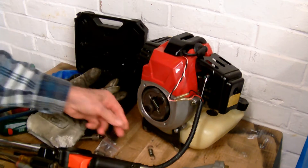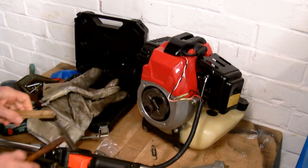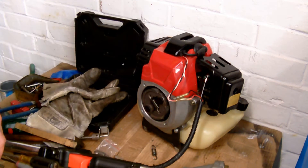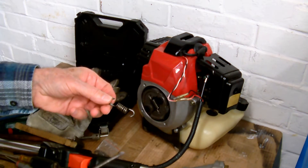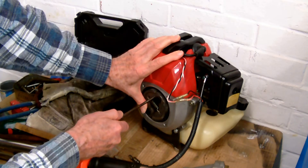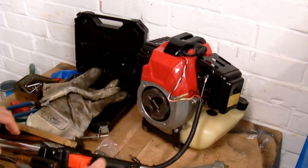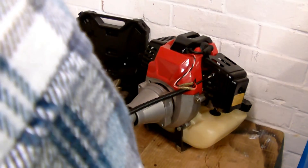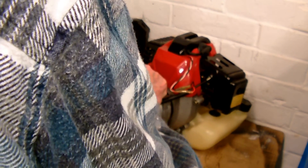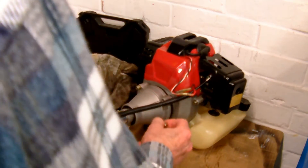It's still standing proud, so then you can just get a piece of wood and a small hammer and tap it in so that it clicks into place — and that ain't moving now. When I had the old spring in there with the destroyed temper I could lever these apart quite easily; now I've really got to try hard to do it. So that's going to fix the job. When you're putting it back, obviously make sure your handle is the correct way up, then just put your four bolts in — they're all the same size. No problem there, except if you lose them of course, which I seem to have done a bit.